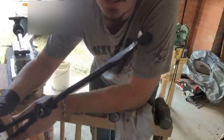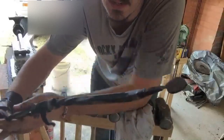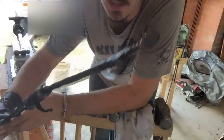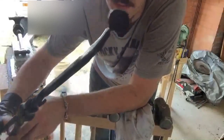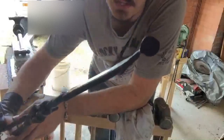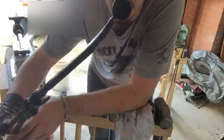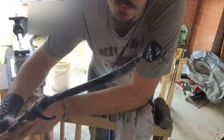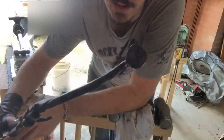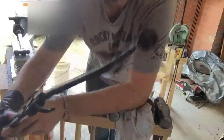What Adric is making is a pendant. He's basically forming this disc of steel. We're going to hot chisel a rune into it. At the moment, I'm just isolating this neck for him because it's a little bit cracky, a little bit stressed from the forging. It's just like a practice. I'm going to cut this off, flatten it out perpendicular to the face, and then we'll punch a hole through it and you can actually thread it as a necklace. Should be good, but bear with me, I'm just going to go cut off this neck.